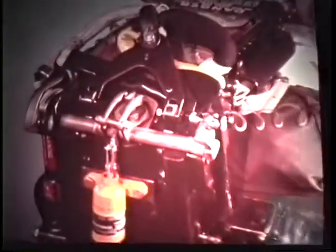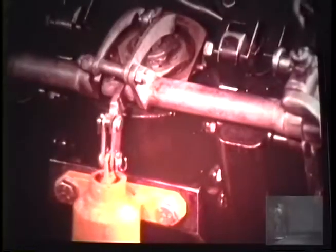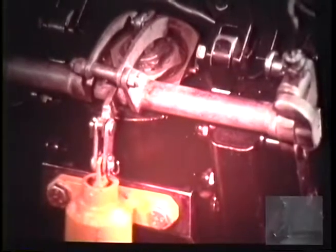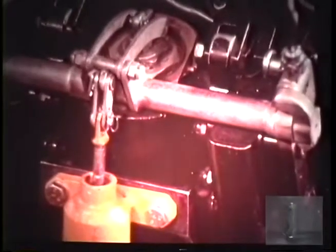But now, let's follow a Martin Baker seat ejection step by step, taking a closer look at each event that occurs during the sequence. As we have seen, the sequence begins when the air crewman pulls the face curtain handle, or the secondary ejection handle, between his legs. This rotates the torque tube and firing lever and the canopy interlock mechanism. It turns far enough to pull the firing pin from the seat-mounted initiator and to contact the banana links.